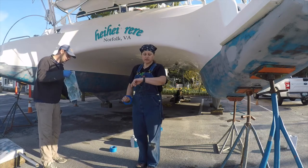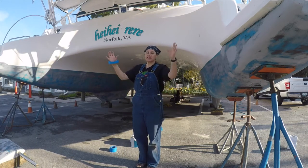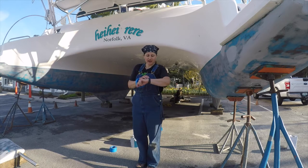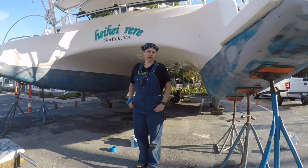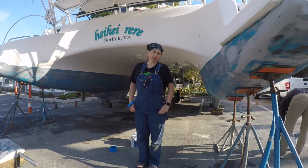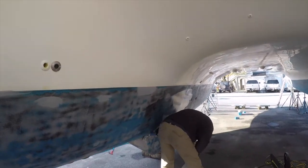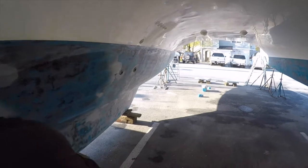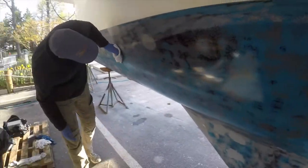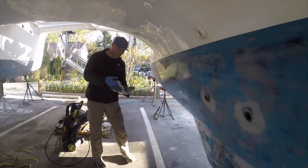It is Tuesday, April 20th, and it's supposed to be sunny all day — high 70s, low of 52. We have to keep the temperature above 50 degrees, and even the surface of the boat should be above 50 degrees as we apply the paint and let it cure. The label says we need to let it dry for 36 hours.